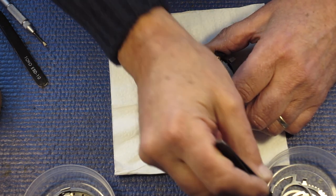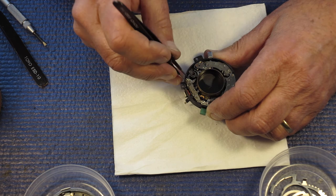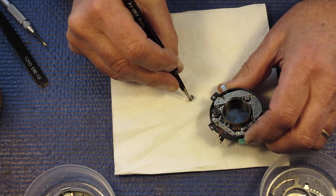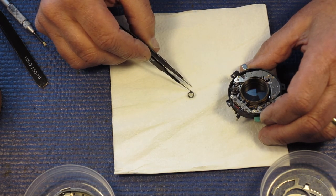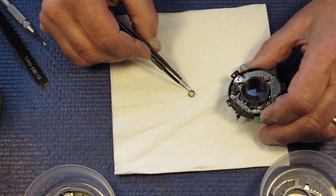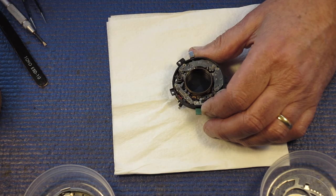This comes off — a spring that was hooked over that post. Here is your main drive cam and its spring. We can take the spring off at this point — that just unhooks. Now the relative position of the two tabs: with that tab at 12 o'clock, this one is sitting right down at about 3 o'clock. In an ideal world this would be much tighter — up around the 2 o'clock or 1 o'clock position — but we have to make do with what we can get.